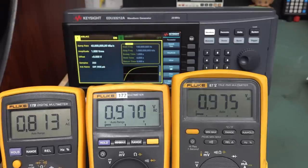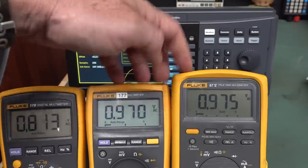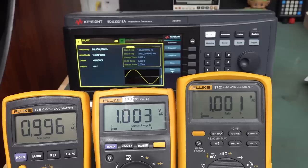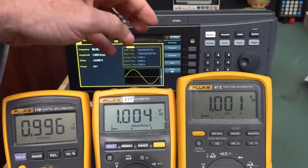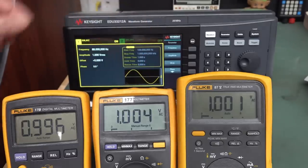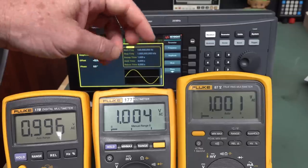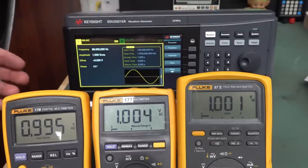And sure enough, there's that 1 millisecond pulse we had before — not too shabby. I did it! I converted a Fluke 77 Series 4 into a Fluke 177. The 70 Series was average responding but has the true RMS capable chip in it. The entire 170 Series is true RMS. Don't recommend doing this at home unless you have the ability to calibrate all those ranges.